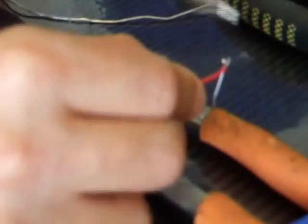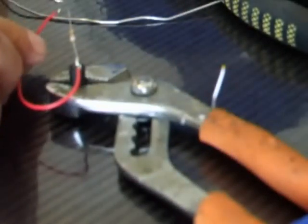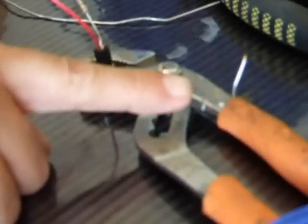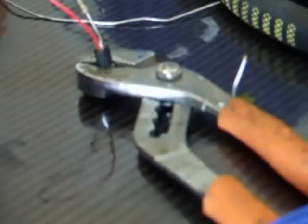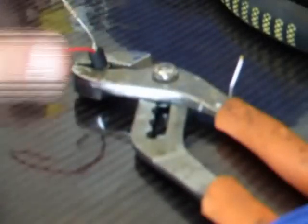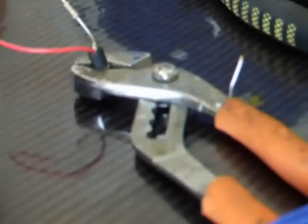So really what we are talking about here, one of the main things that we've got to do is make sure that we tin first — tin your tip, tin the wire that you are soldering to. This has already been tinned; I can touch them together now and literally that was just a little touch. The best thing to do is have a practice. You can see how solid those joints are — they're now picking up that switch in the vise. This is a real good aid: a little bit of solder in there, it will hold, you can work without having to juggle a wire in your fingers and a bit of solder at the same time. Just push the wire down inside the insulation on the pliers there and you'll be fine.